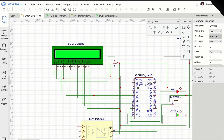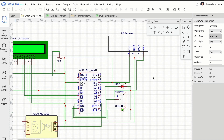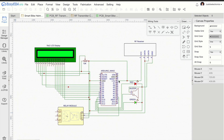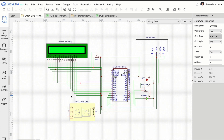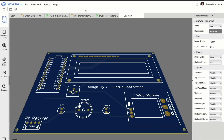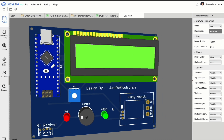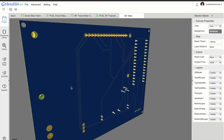Let's look at the circuit diagram. I used EasyEDA software to create the circuit diagram and converted it into a PCB layout. I connected the RF receiver and supplied 5 volts. On the left side I connected the 16x2 LCD display, connected to pin numbers 3, 4, and 5. When converted to layout, the circuit looks like this — this is the receiver circuit diagram. When converted to a 3D module and printed out, the PCB looks like this. This is the back side and this is the front side.